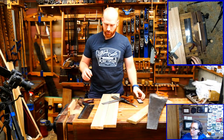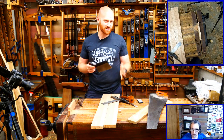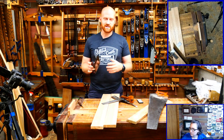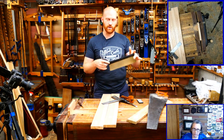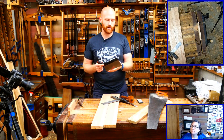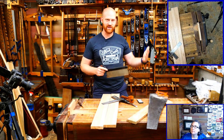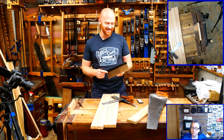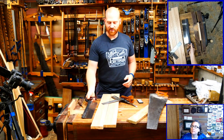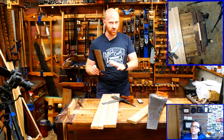When a saw is always veering to the same side, it's probably the saw - don't assume it's just your problem. The only way to tell is to use that really loose grip and let the saw do the cutting without any force. But that can be very hard for a beginner, because you need good form to tell if it's the saw or not.